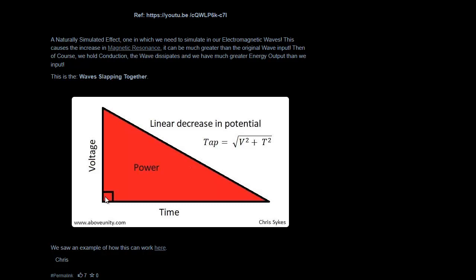So here it is here. The higher our voltage amplitude through time, the more current that can be pumped by your partnered output coils. By getting our amplitude up, and you also see this in Ohm's law, by getting our voltage amplitude up, which can be done various different ways. Obviously, I just want to say voltage is generated. How do you generate voltage? It's the time rate of change of the magnetic field with a certain value. The magnetic field has to have a certain value, has to change in a certain amount of time, and the amount of turns. So turns, the magnetic field value, and the time that it changes in will give you a voltage. Voltage is generated.